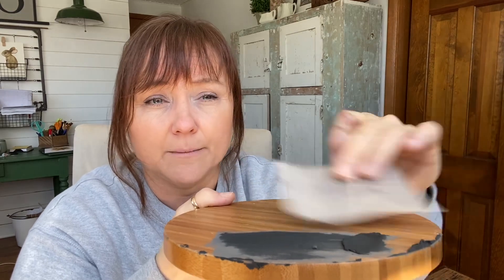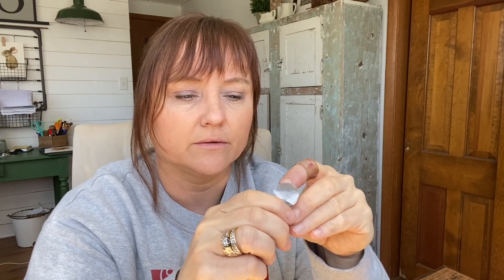You can see here as it's starting to dry — the thinner the layer you put on, obviously the faster it's going to dry. When working with this stuff, make sure it's fully dry before you sand it at all. If you're not sure, let it still sit. If you start sanding it before it's dry, it's just going to gunk up your sandpaper and you'll have to redo the process anyway. So just be patient and wait for it to fully dry. And again, do not rinse this off in a sink — you do not want it to harden in your pipes.